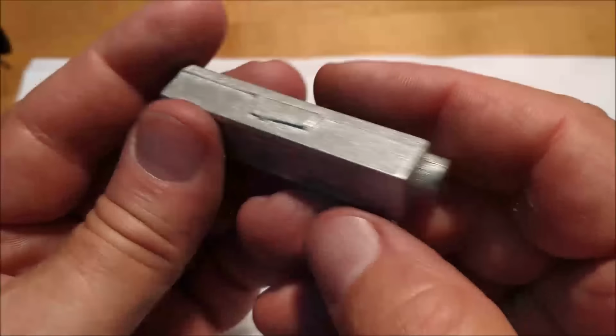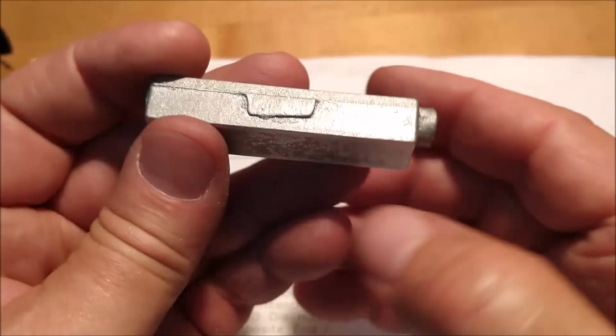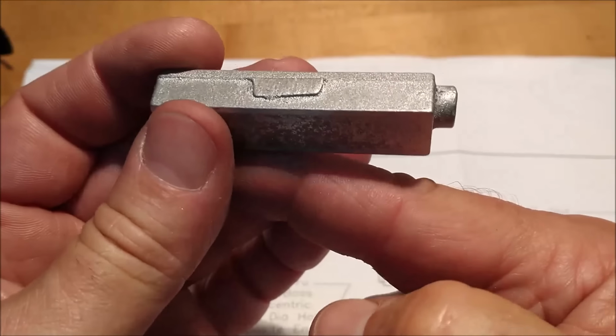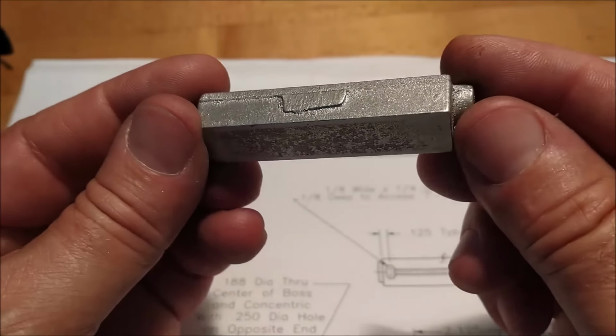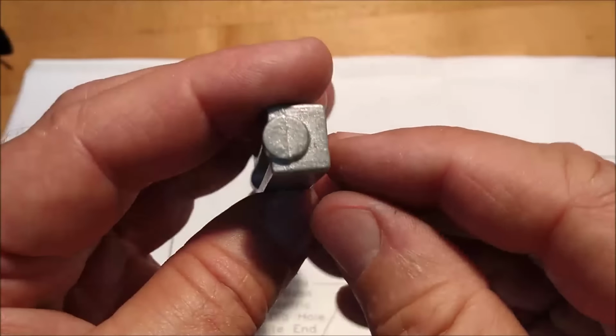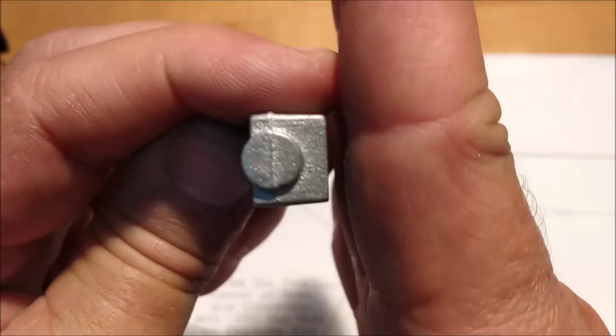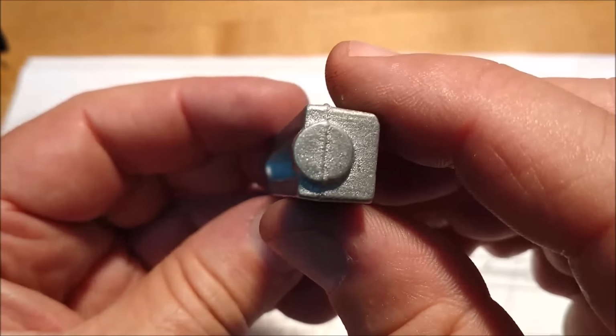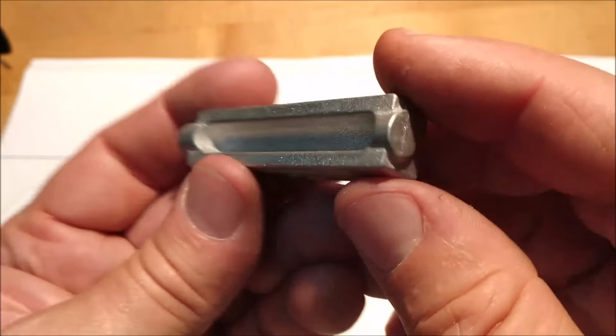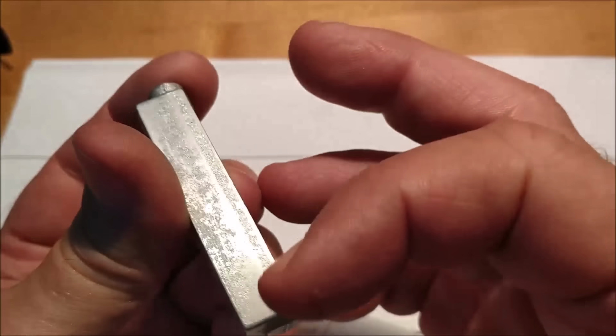If we were to flip this around and the draft is up, the pin could walk out, and as the pin walks out, the part tangency will change. So keep that in mind, guys. You want the low side of the slope against the back jaw to form a locking feature when it comes down on the pin. Let's take it over to the machine, stick it in there, dust this side, dust that side,